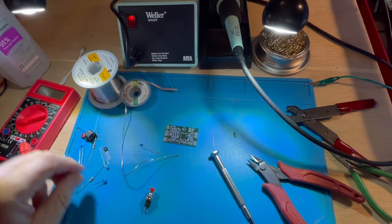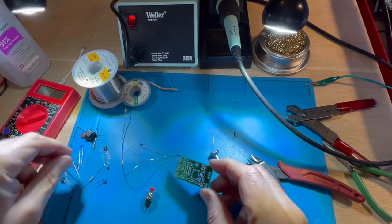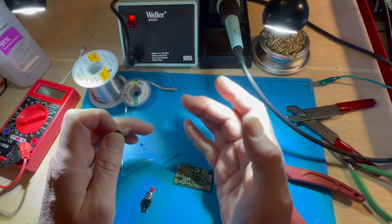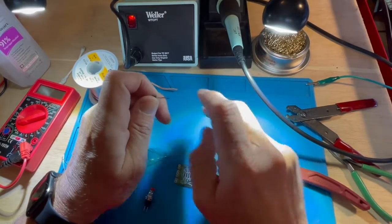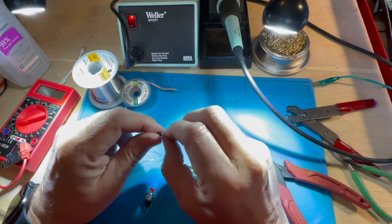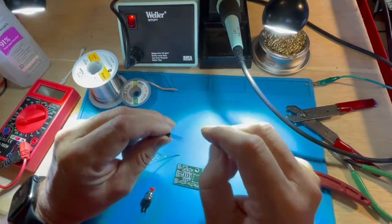Okay, let's next put in a transistor. And remember I'm grounded, this pad is grounded, my hands are always in contact with the pad. Oftentimes there are wristbands that you should use and clip to this to make sure your whole body is at the same potential. That makes for a good anti-static type of assembly operation.